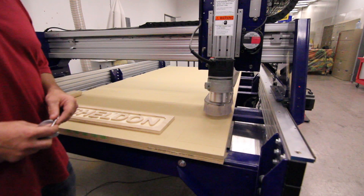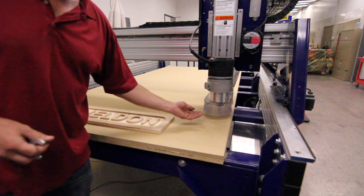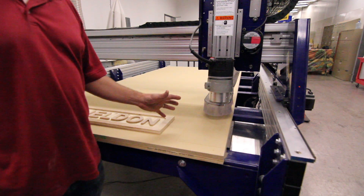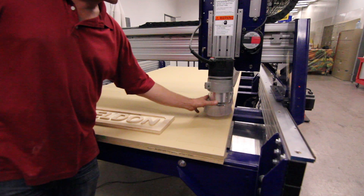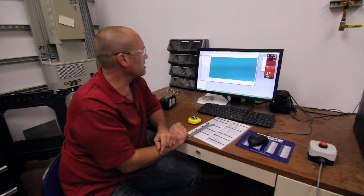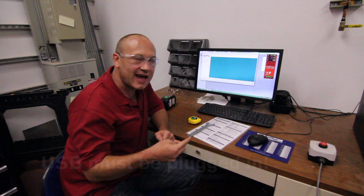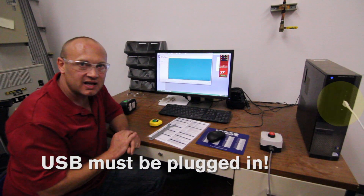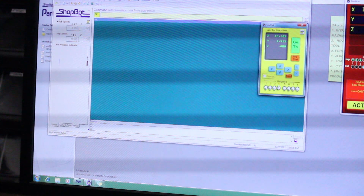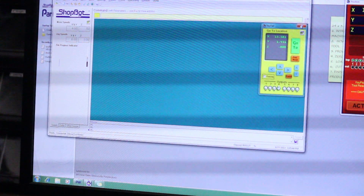Now that you've had a basic introduction to the machine, the next step is to load the tool — deciding what tool you're going to use for your job. That tool is located underneath what's called the dust skirt. I'm going to show you how to get that up to a working height. First, we go to the computer. On the computer, note that there's a USB cable from the tower to the machine — that has to be plugged in. Nothing happens if it's not communicating to the ShopBot; it will just give you an error. On the desktop, you'll see an icon that says ShopBot. That's the main operation program, and you'll open that and hit the magic key K.